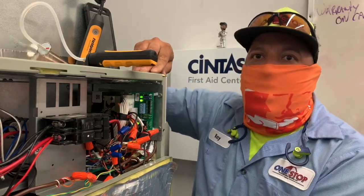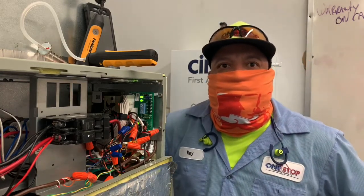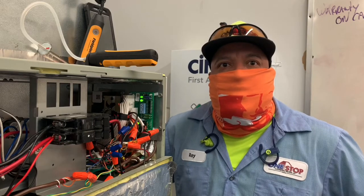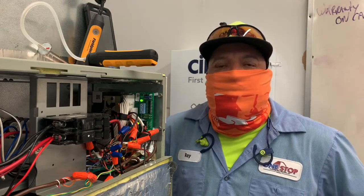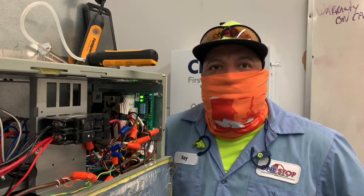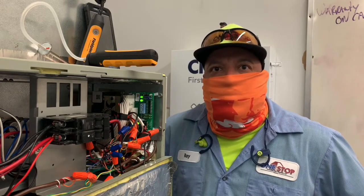And I don't know if it's the chicken or the egg — in other words, I don't know if it's what it's telling the blower to do, or if it's trying to confirm to you that the blower is doing it. I'm not sure which one it is. But I can surely tell you that I'm pretty confident I could look at that and get an idea if I'm in the zone before I start getting out a manometer and checking static pressure and going back to the blower chart. If I see that I'm in the right zone, I don't let my brain go down that rabbit hole at all.